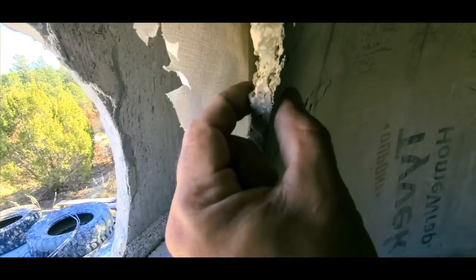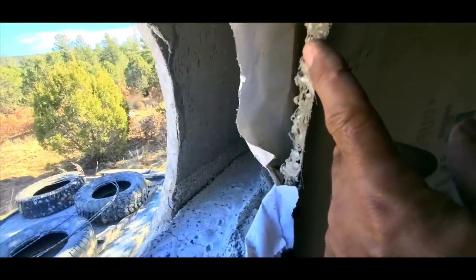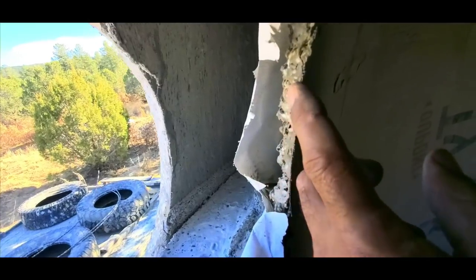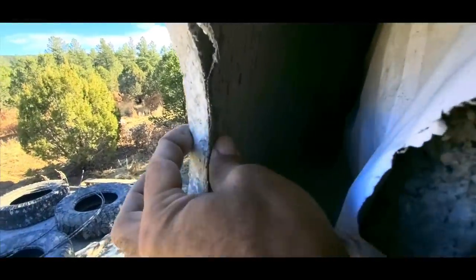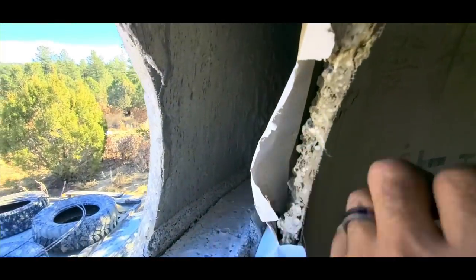Here's a great example of the shell thickness. For this workshop I wanted to teach the EPIC mix, so instead of just sand and cement we used the EPIC mix — specifically the ironwood mix — to make these two shells. The outer shell is much thicker, about a half inch thick, which is definitely solid at that thickness. The inner shell here is about a quarter inch thick.